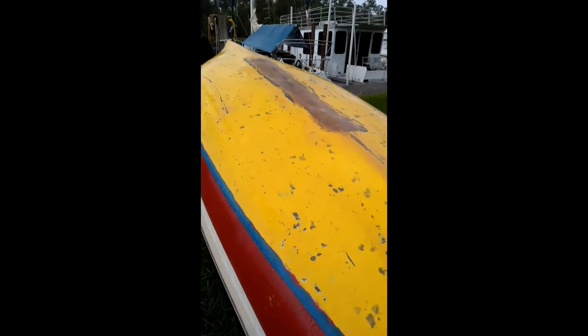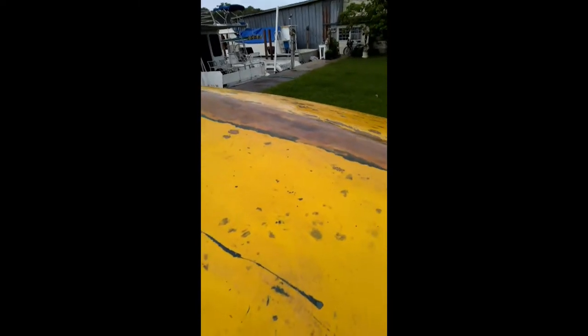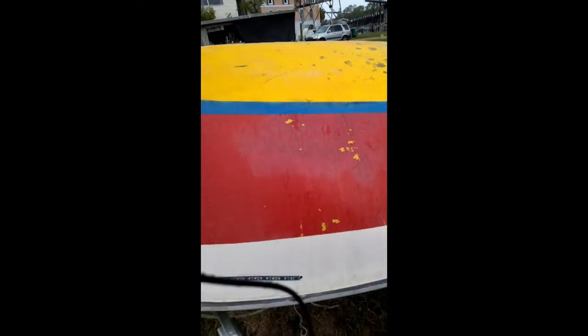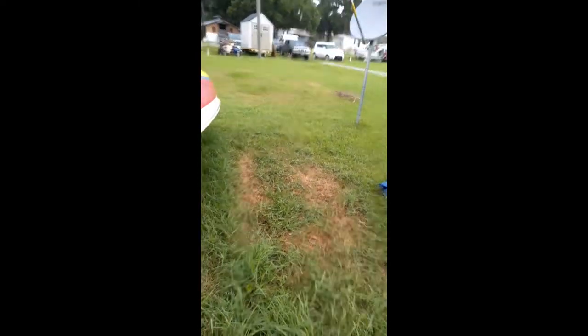Here's Little Red — we've got her down to her base paint. I used marine resin with silicone thickener to fill in all these little holes. Those little dark spots you see are all pinholes that were in the hull — that's why she was taking on water. We've sealed all that up. We're just waiting for the rain to stop so I can put the bottom paint on, then we're going to touch up the sides. We've got the new LED strip lights all the way around — boat's going to be electric when it's all done.